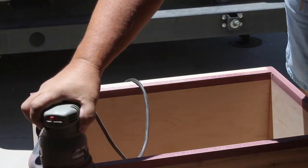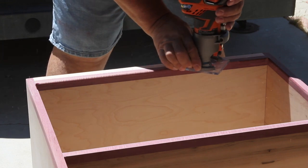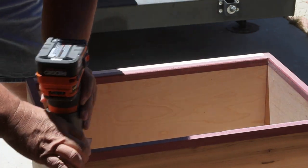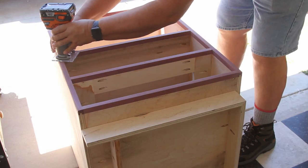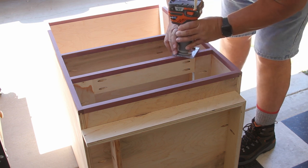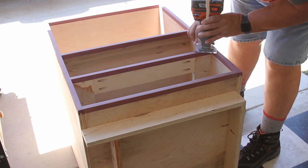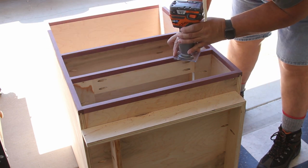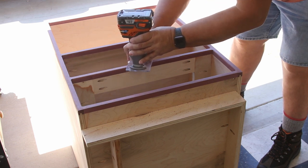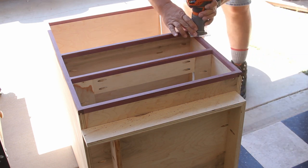Moving on to the face frame, that's going to involve some sanding on the purple heart and maple to make sure it all blends together. It took a little bit of time, but eventually I got it all smooth and ready for the next step. I pull out my compact router again with that same quarter-inch roundover bit and go on all the inside pieces and one side of the cabinet to round over all the purple heart so there are no sharp corners. By holding your finger down on the base right on top of the edges, this gives a stable cut and allows it to follow the edge without flopping back and forth.